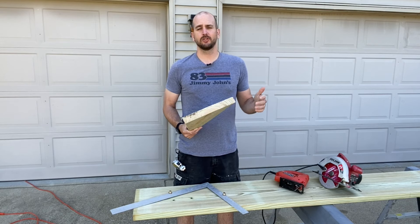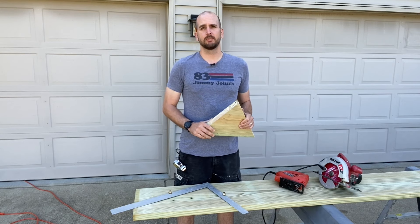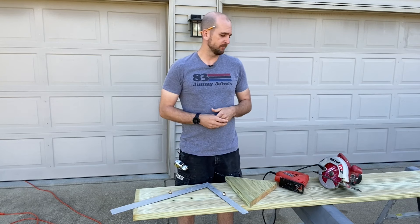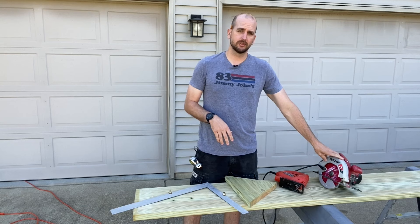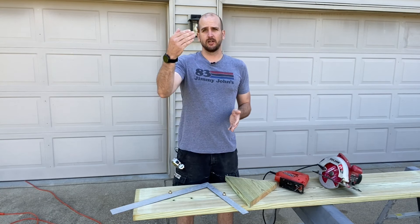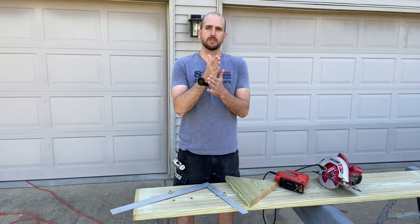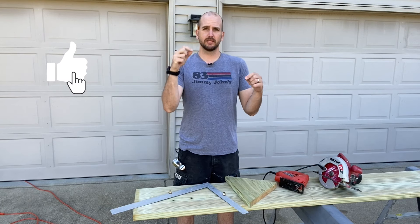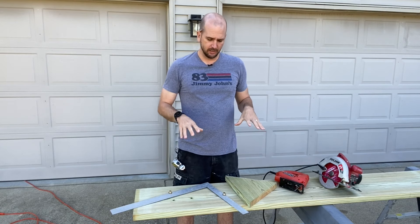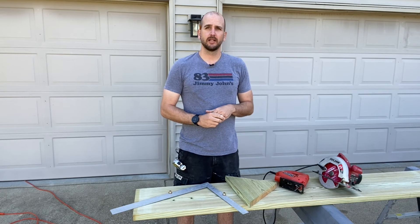If you see burn marks when doing your cuts, your blade is probably worn out — and if you're only using it a couple times a year, that's a definite possibility. It's worth getting a nice sharp blade; they're usually only eight to ten bucks. I'll do most of the cuts with the skill saw but finish with a jigsaw, because the circular saw cuts an arc and cannot cut right into the corner of your stair. You'll cut up to the top corner, then use the jigsaw to complete the remaining material at the bottom.